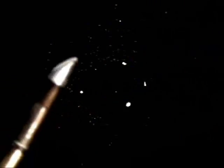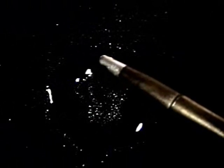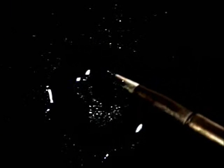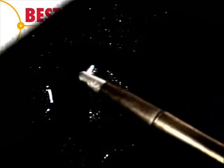Again, clean off any excess solder before you do this. I cleaned it off into the center of the hole. Now the next thing I'll do is come in here with a brass brush in a downward motion and clean it all the way around. And if it still won't take solder, I'll dip it into the flux and then start adding solder while I'm doing that, and a lot of times it'll bring it back to life. See how easy that is to do? There's nothing to it. Okay, so that's how I would maintain my tips at all times.